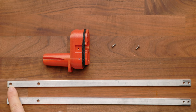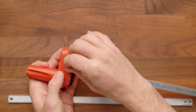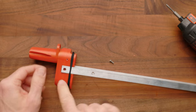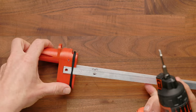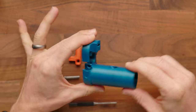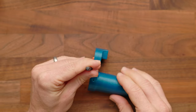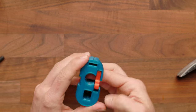Now install the bars — take the larger hole end (not the tapped hole) and slide them in, then screw in one 4-40 screw. Note the screw holes don't actually clamp the bar down but should be passed flush; this is dual-purpose hardware from Captain Slug products designed by SillyButs to avoid special machining. Then slide in the pivot piece and drive a short pin through the hole, tapping it just far enough to be flush. It should still rotate freely without too much side-to-side play.